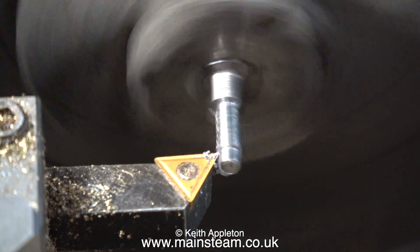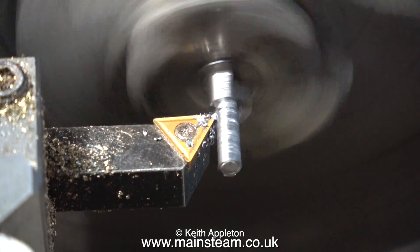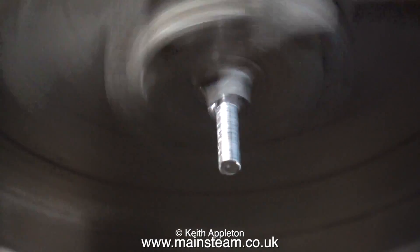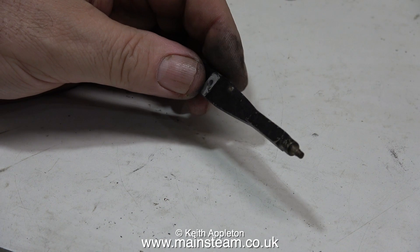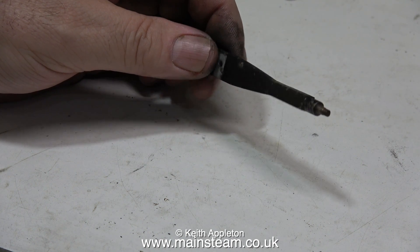It occurs to me that I may get a message or two from some experts saying 'why don't you centre-drill the end and turn it between centres?' — and the answer to that is because I don't want a centre hole in the ends of all the brake beams. After a final clean-up with emery cloth followed by a quick touch on the one-inch belt sander, here are the finished brake beams. I'm quite pleased with them — when they're painted they'll look fine, and the manufacturing process is far simpler than doing it the hard way.